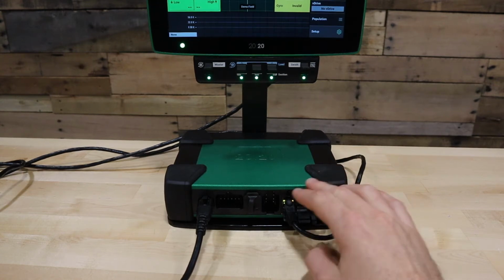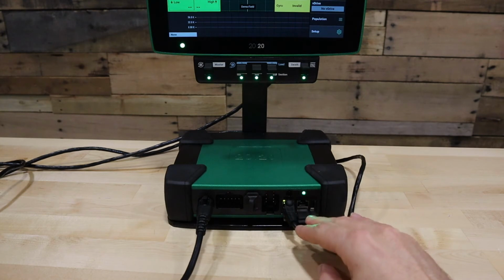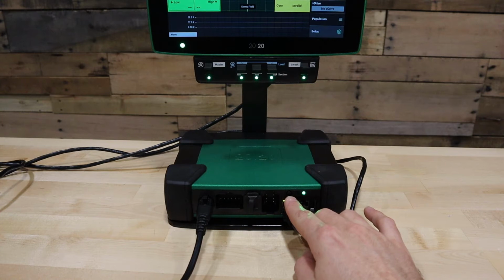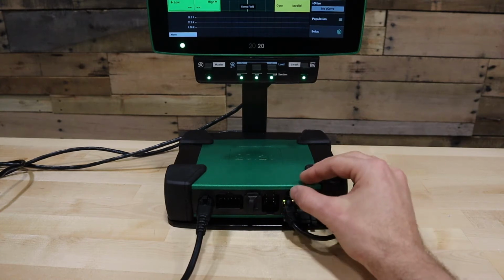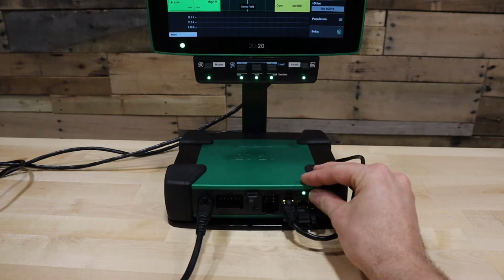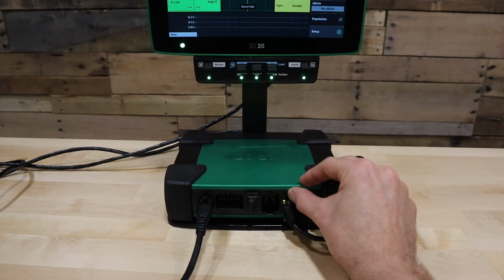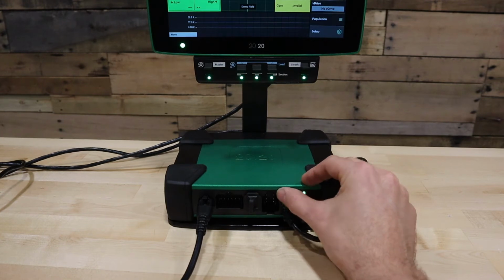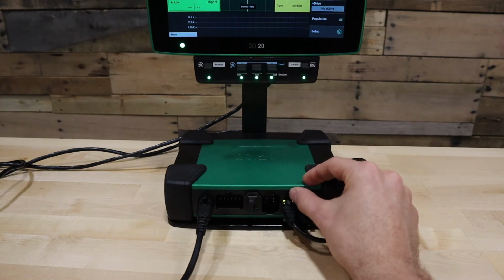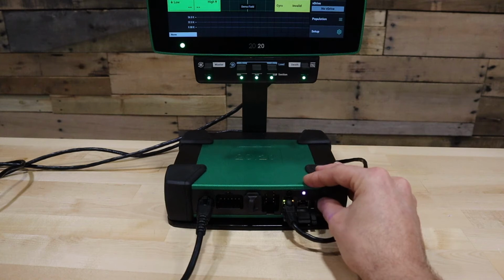On the DBM, on the side where the connections go into the DBM, right above the Ethernet cables, there is a power button to turn the DBM on and off. When this power button is flush with the casing or inserted into the DBM, that indicates an on status. When this button is out of the casing and no longer flush, that indicates an off status for the DBM. Verify that the power button is turned on so that the system can start up.